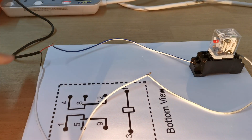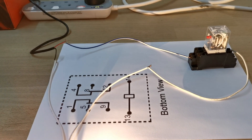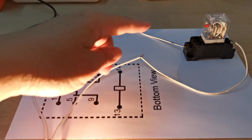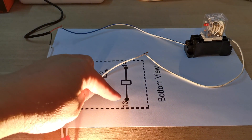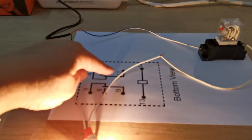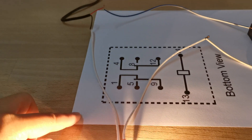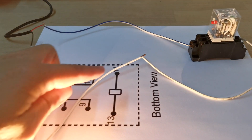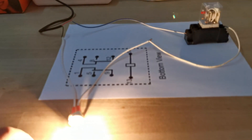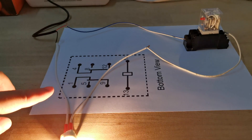So I'm making a series circuit now. Under normal circumstances, the EM lock is working. But when the fire alarm triggers and sends power to terminals 13 and 14, the connection between terminals 1 and 9 will be disconnected — it actually switches to connect terminals 5 and 9 instead. Now I'm going to connect power to terminals 13 and 14 to simulate the fire alarm trigger, which will release the EM lock, meaning the light bulb will lose power.